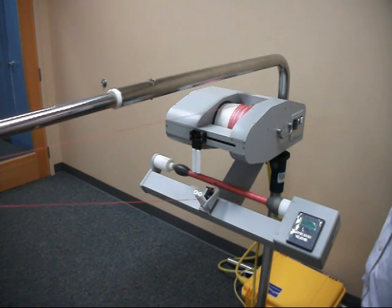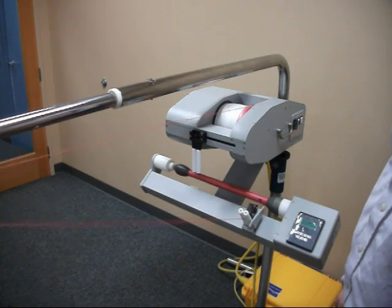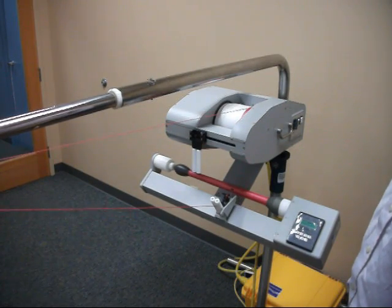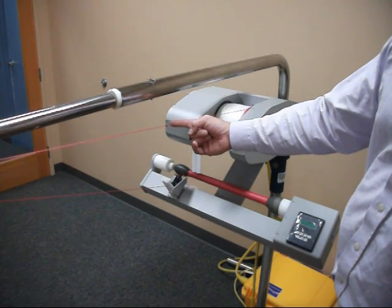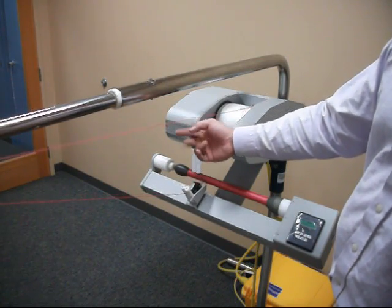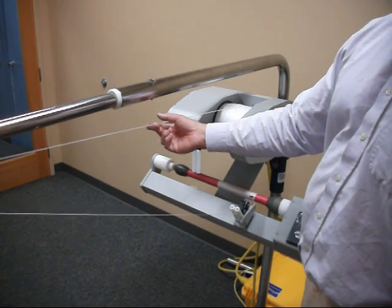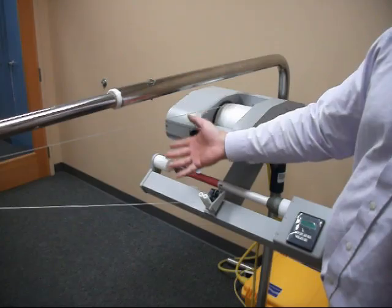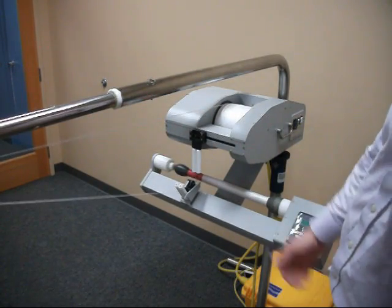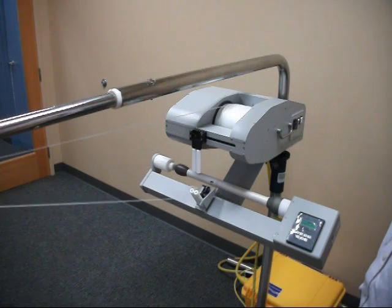You may notice, if you look really carefully when you're doing this, that compared to a new winch or a winch that's properly adjusted, the amount of movement in the line here is greater. With the tension being lower, there's less pull on the line, keeping it taut. So you'll see there's already signs here that this isn't quite right. But looking here at the tail spool, everything looks fine at this point.